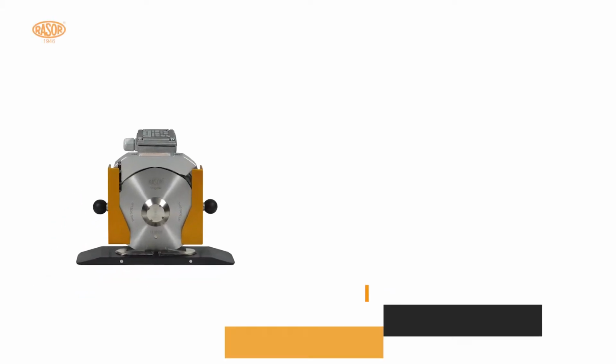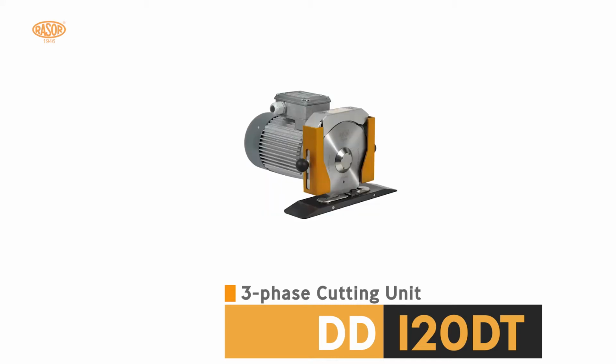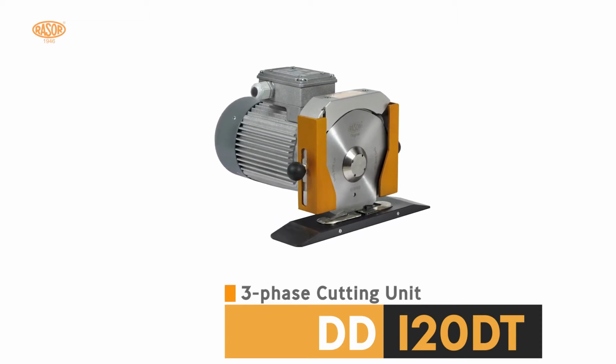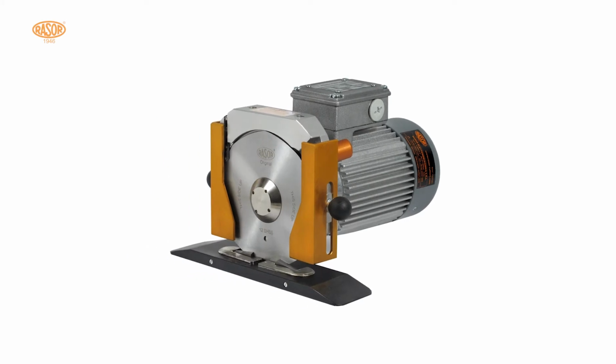The Rasor DD120DT is a three-phase cutting unit for textile, technical fabrics, and composite material. Thanks to the double carbide counterblade, the DD120DT is able to cut in both directions through an inverter. This peculiarity allows it to save one run, and so time, in the crosscut process.